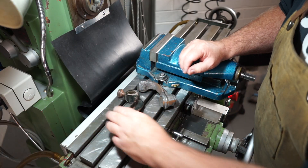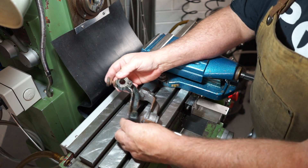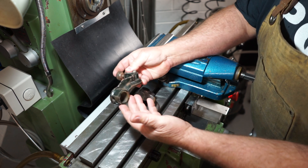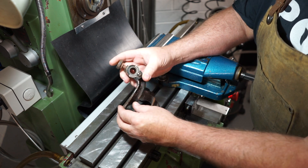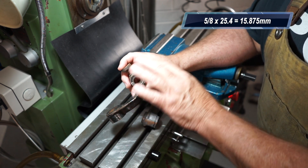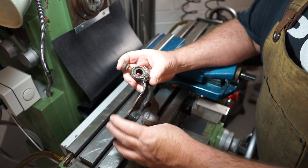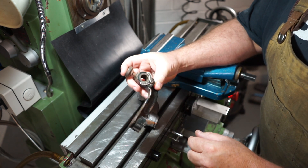Come on over to the mill and I'll show you what I'm working on. I've got the two parts here that I need to work on today. This is the original part and it's got two holes and a couple of tapped holes. This bore size here is one inch and this one here is five-eighths of an inch. However when I measure this, it's actually 16 millimetres. Five-eighths is slightly under 16, so I don't know why that would be metric and this one would be imperial. The engine's over 100 years old so it would have been imperial back in the day.